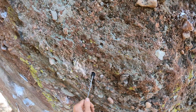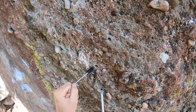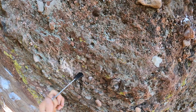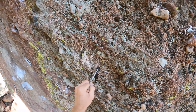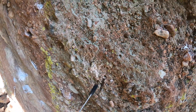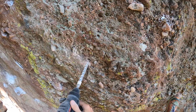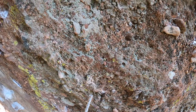So now we bring out a brush the diameter of the hole. There's lots of dust in this hole and we've got to get it all out, or it's not going to have good adhesion. You just oscillate between a couple of brushings and then stick the blow tube in it. We're trying to go until there's absolutely no dust — we really don't want dust coming out for the best adhesion of the glue. Maybe do this five times, and you're only going to do it once for this bolt so you might as well do it right.